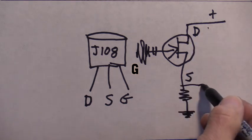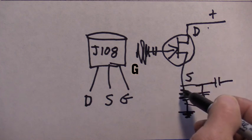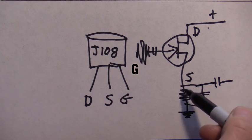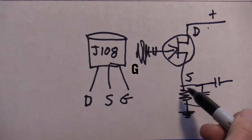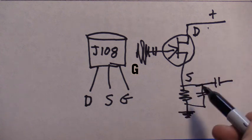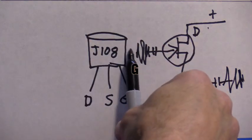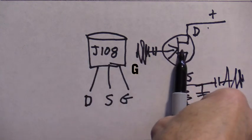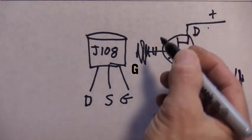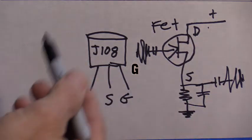And this one, the signal comes off between the source and this resistor, and that's going to vary from, I found out, 475 k ohms to a couple megs will work. You can try different values there and different values for this cap as well, and your signal comes off here. So off the coil, RF hits the coil, you develop a current in the wires, and this detects it and amplifies it. So this FET is better than the germanium diode I showed you earlier.